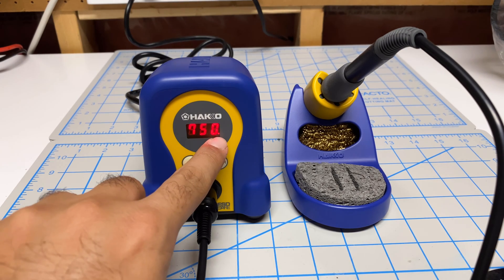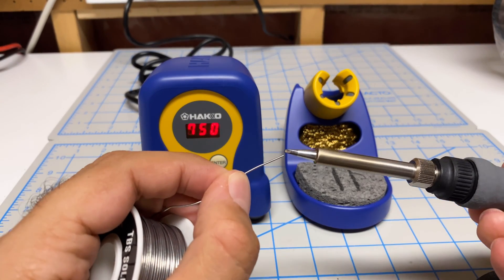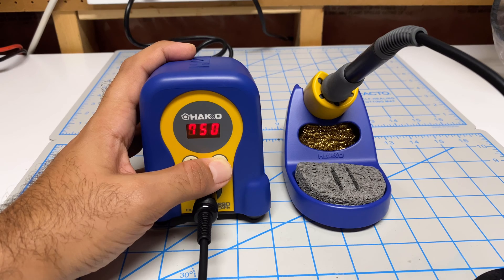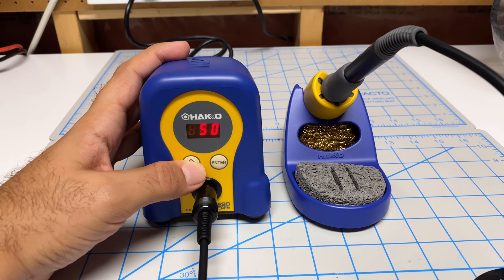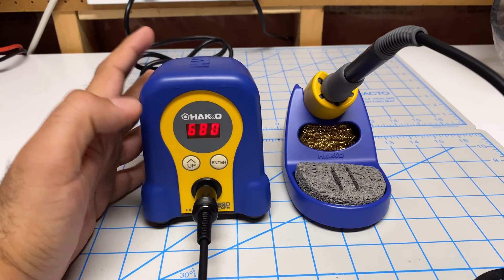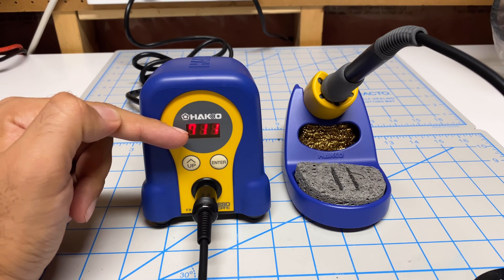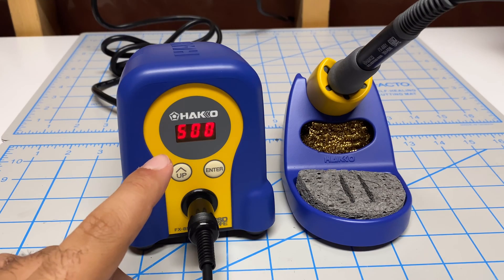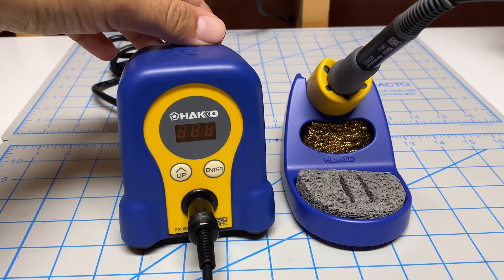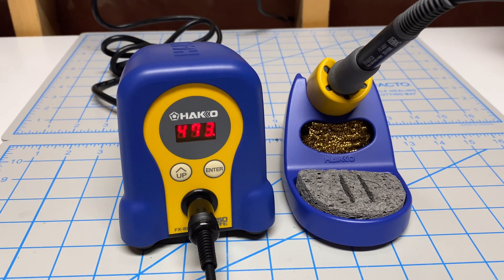This little flashing light means it's actually heating. Let's go ahead and put a little bit of solder on here — look at that, it's smoking. We can adjust the temperature by holding the button down to increase or lower it. So let's go down to 650, or 680. It shows the current temperature when it's not yet at the preset temperature. What I'm noticing is that it remembers your last set temperature — so if we're at 500 degrees, turn it off and back on again, it'll be set at 500 again.